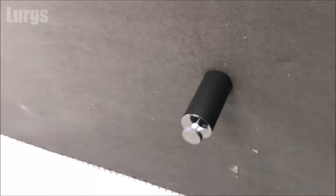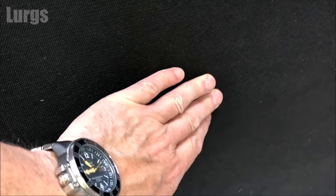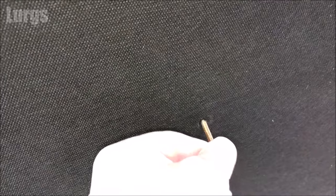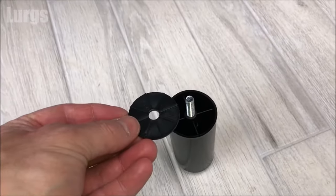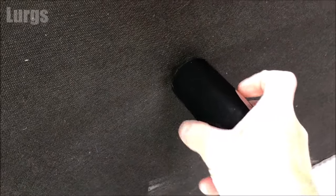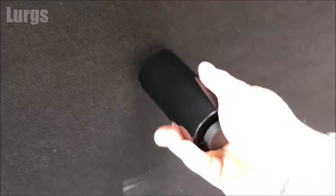It's best doing the adjustment at the end once the four legs are on each corner. Let's find the other hole — DFS haven't put the hole in for us again. Take your finger, I can feel it here, just going to spin it round so you've got a nice indentation, then push the screw in to make the hole. Again, put your washer on with the grip facing upwards, push that in and screw it in clockwise, nice and tight, as tight as you can get it.